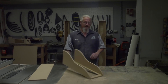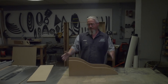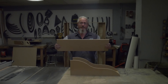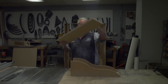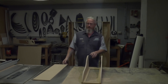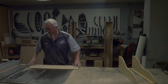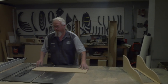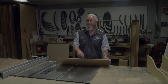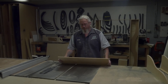We're going to start off with this already mocked up like a small console. You could actually build something bigger and make it a sub enclosure if you wanted to. Basically, we're going to take this flat piece of wood — can't bend it now — but we're going to make it fit this shape right here. The technique is called kerfing. We're going to run it through the table saw with the blade almost all the way to the top edge of the wood.